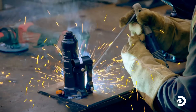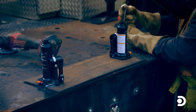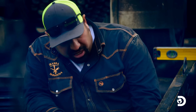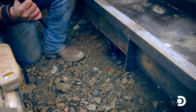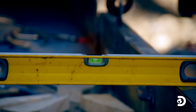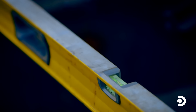To adjust the pitch of the new fine gold sluice and control water flow and pay dirt, Freddy and Juan have a cheap but effective hack. We got the new sluice box in place — Freddy got these two little bottle jacks welded onto a plate to use as the adjustment. We can adjust the pitch or slew side to side to get it perfectly level. Thirty dollars worth of material — look at that, it's dead nuts level. We can adjust it however we want.